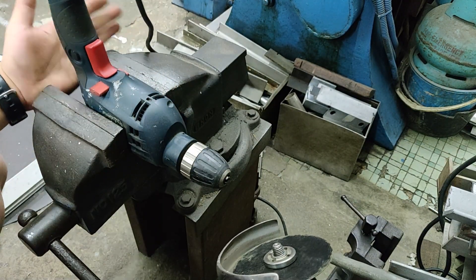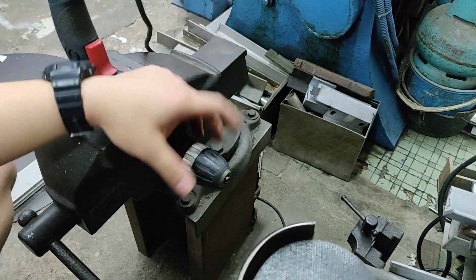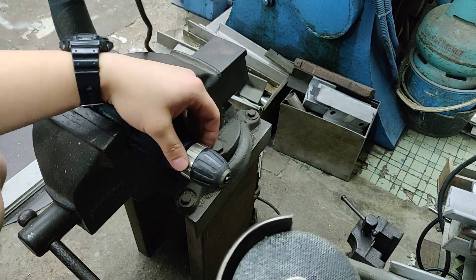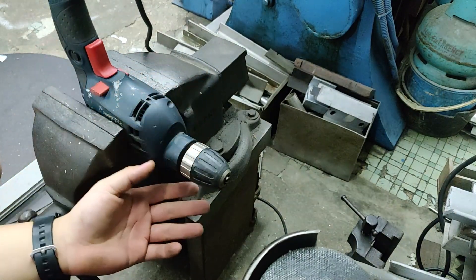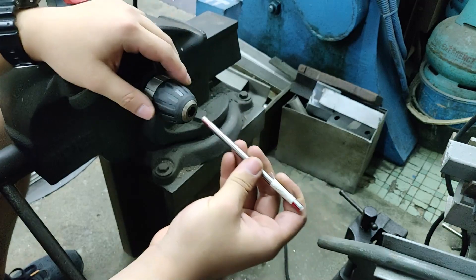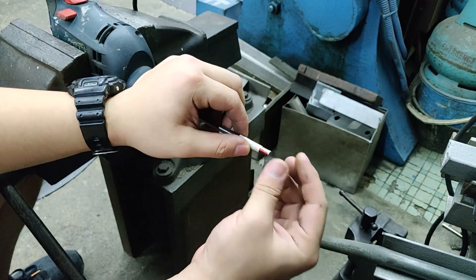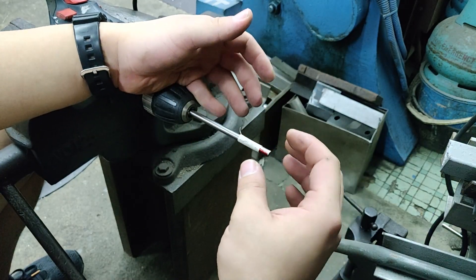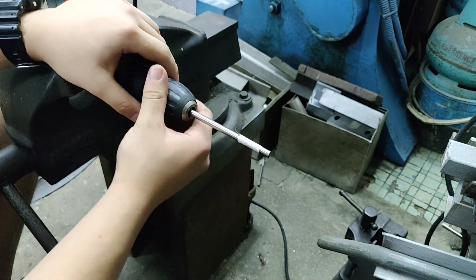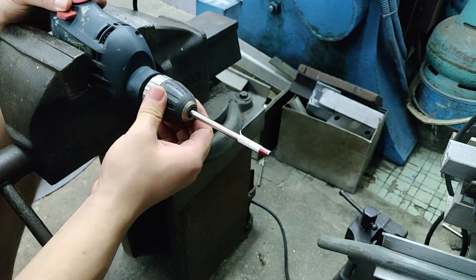The red parts are going to be ground down to around 4 millimeters and have the thread tapped into them, while the middle stays at a diameter of quarter-inch. This is the setup: the drill is clamped into a solid base — make sure it doesn't obstruct the vents for cooling. Importantly, if you're using older hardware, make sure the bearing holding the chuck isn't shot, because if it begins to wobble your links will be uneven and it could be potentially dangerous.